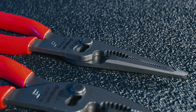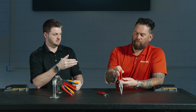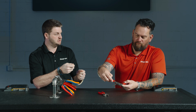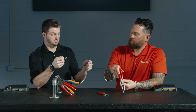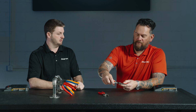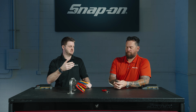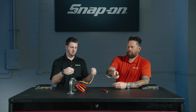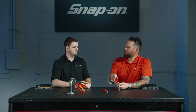So when you machine that pocket, it allows us to put a precision pin in there to be able to hold that and keep it from deflecting. The second, which is more for user perspective, is it allows the user to move from positions 1, 2 to 3 and back, right? So it's much easier to be able to go from one to the other quickly and efficiently with one hand, because sometimes if you're grabbing a hold of something, you can't necessarily grab it with both hands and make the adjustments. So you want to be able to do that with one hand and do it smoothly and efficiently.